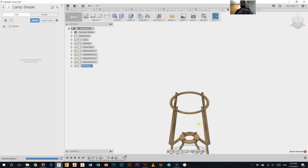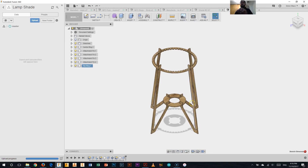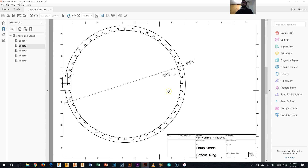So there's our top ring, our attachment fins, and our centre ring — all completed. Now we need to do the next one, which is our bottom ring. We'll just change our page on the drawing. Again you can see some of the dimensions — three and five for the notch, radius of 111.84 for the centre, and 243.67 for the outer.